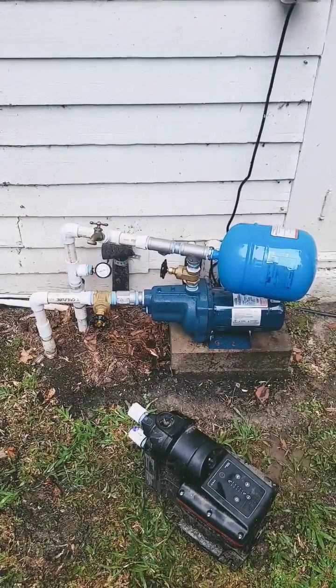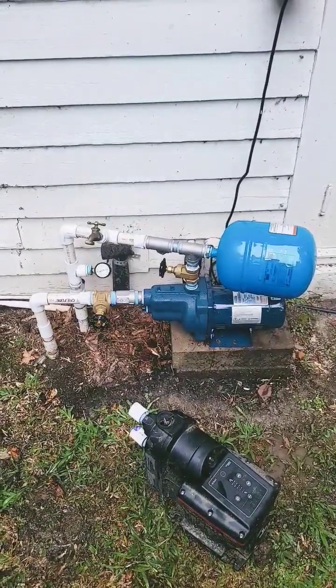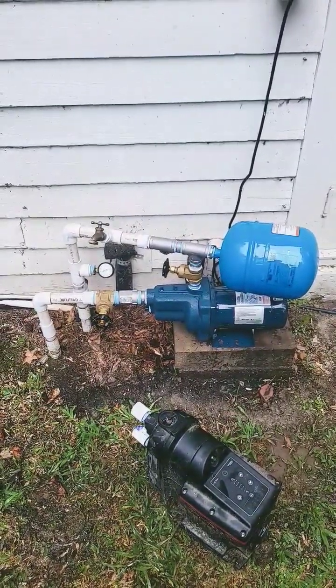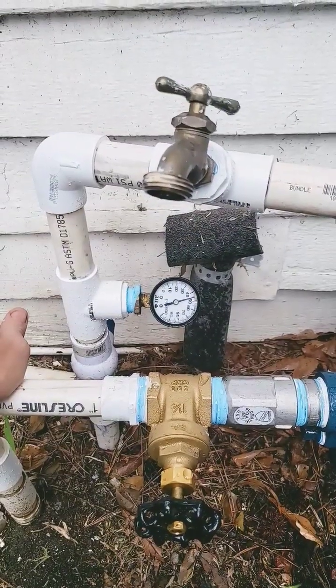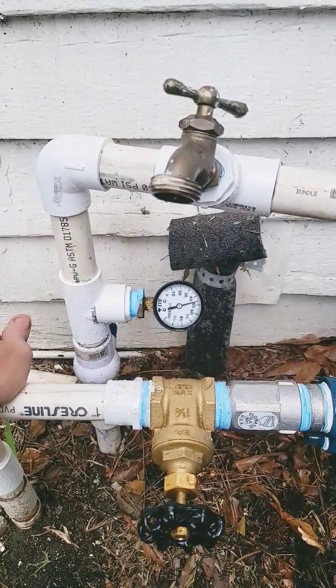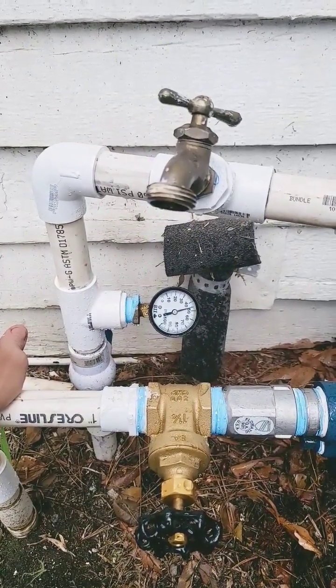So I got Ms. Lynette a solid-state solution — a standard pump with a standard tank, set up to be a standalone booster system. Right now her heat pumps are running and it's keeping right under 50 psi. With both units running it holds about 35 psi.